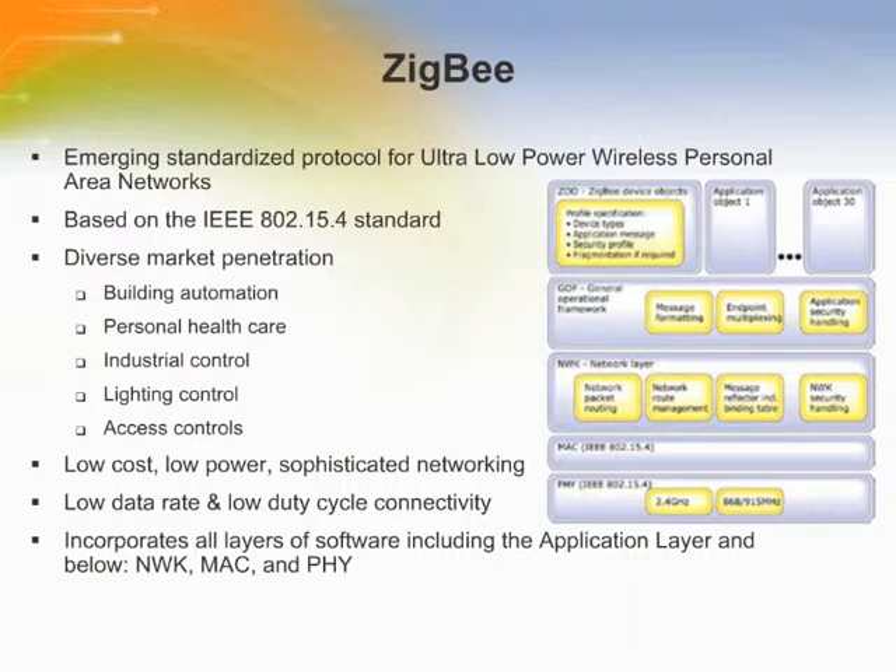The protocol is the work of and property of the Zigbee Alliance, a consortium of more than 70 companies who have joined together to create and promote the new standard. The standard focuses on low data rate, low duty cycle connectivity, a market segment not serviced well by existing standards. Zigbee is a hardware and software standard built on the recently ratified IEEE 802.15.4 standard. It defines the physical and medium access control layers, and the Zigbee Alliance has added network and application layer specifications to complete what is called the Zigbee stack.